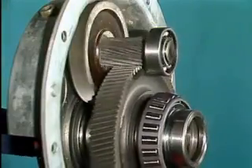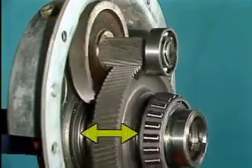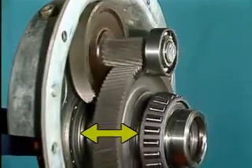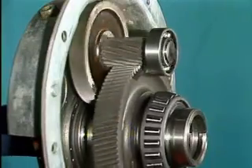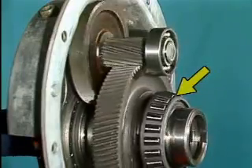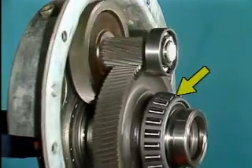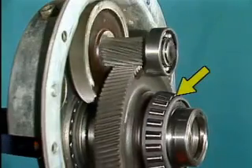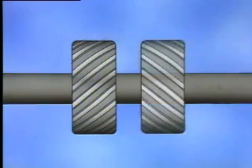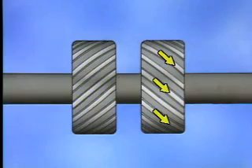The problem is that as helical gear teeth mesh, an axial thrust is developed along the shafts that support the gears. In other words, the gear and shaft try to move sideways. One way to compensate for this thrust is to add a thrust bearing on the gear shaft. A thrust bearing absorbs axial thrust and holds the gear and shaft in the proper position inside a gearbox. Another way is to add a second helical gear to the same shaft, with its teeth sloped in the opposite direction, which effectively cancels the thrust developed by the first gear.